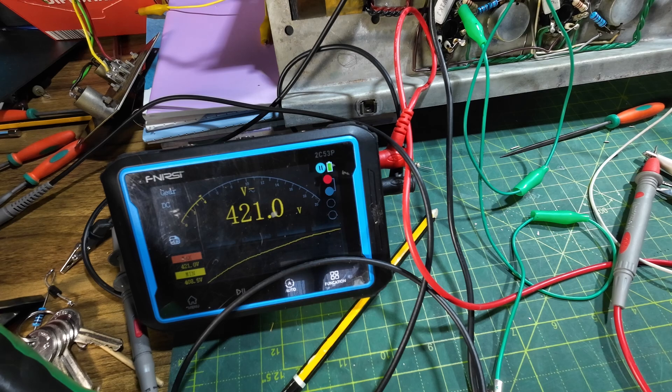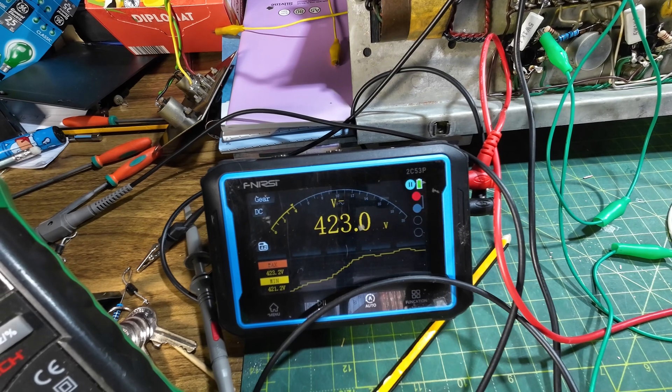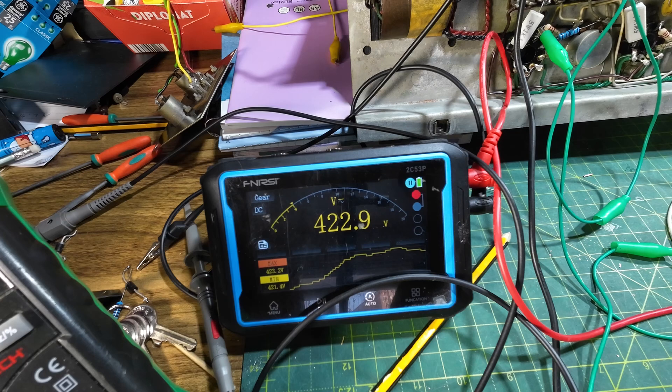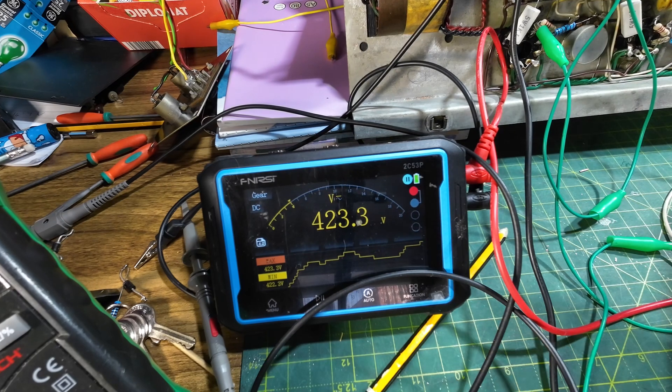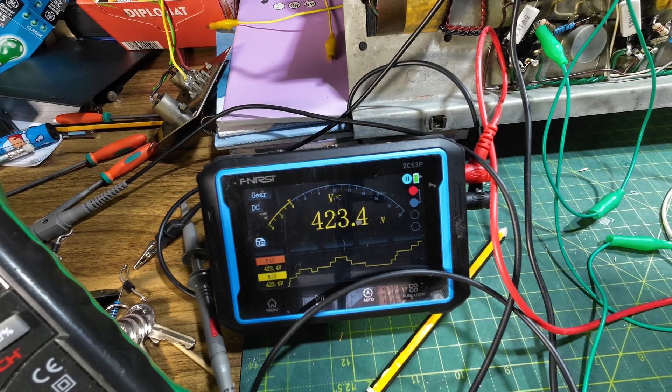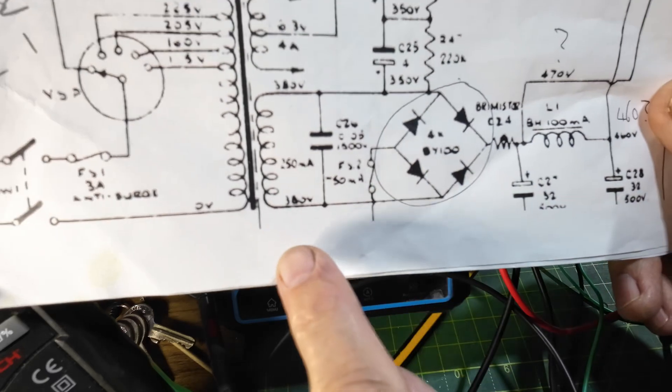Very quickly at 240 volts — much quicker than it's going up now. We've reached 840 volts and it's still climbing. The caps would just get that 800 volts — the question is how long would they stand that for? It's pushing up to 850 volts and it's more or less come to rest there, still creeping. So 850 volts is what you'd have at 240 volts on those capacitors if the filaments went open. It suddenly dawned on me when studying this schematic — probably because I had the whole amp on my mind — but now focusing on just this problem, I can see it clearly.